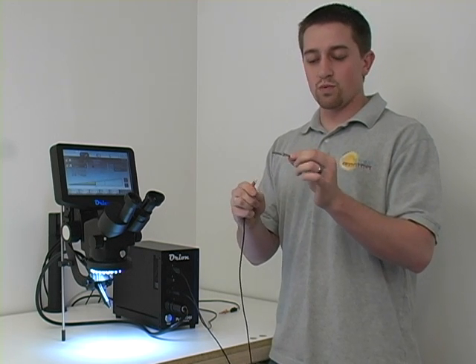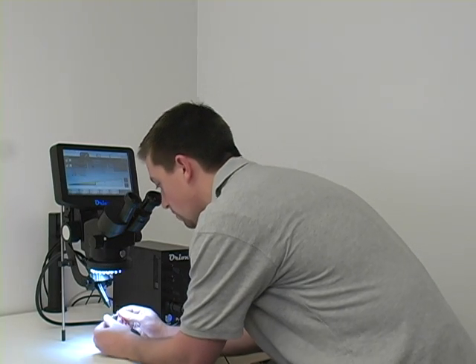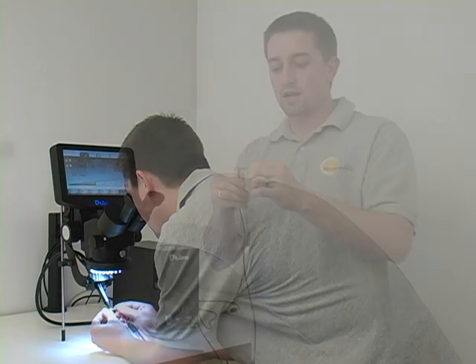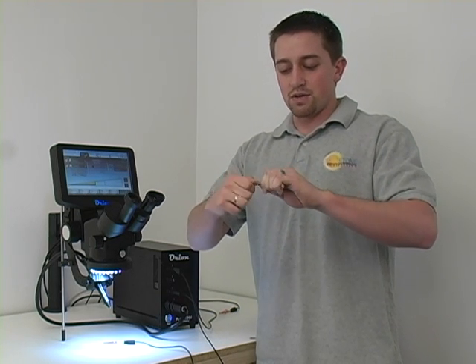After I make three or four welds on one side, what I like to do is rotate that piece 180 degrees and make three or four more welds on the other side. What that's going to do is solidify the weld. You can see just three or four welds on each side gives you a very strong, strong weld. It's not something you can easily break.